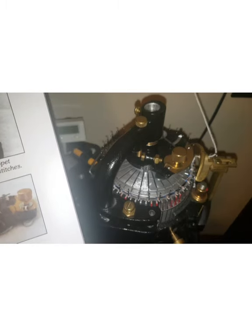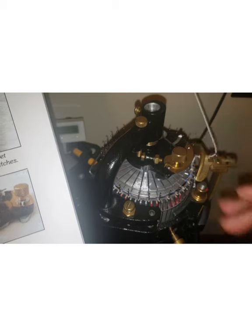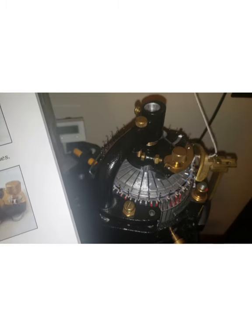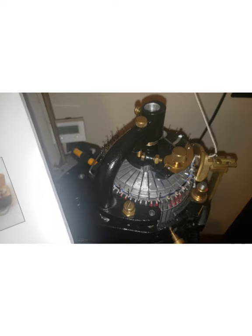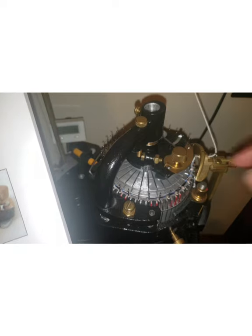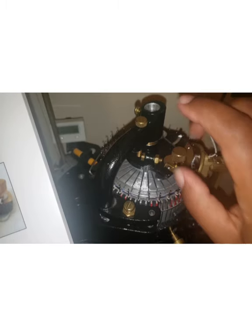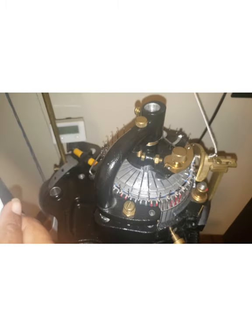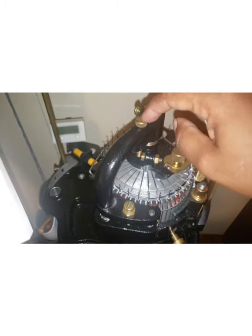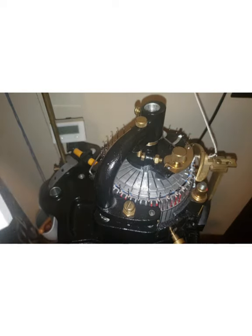The new machines generally come timed, like I said. This should have come timed, but through the hustle and bustle of being packed and being knocked around, or who knows what I did to it when I was assembling it, it had to be retimed. Once I set the timing, I never move this bad boy again. It is fine the way it is. But I do watch it just in case, so it's always my first suspect.